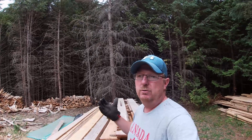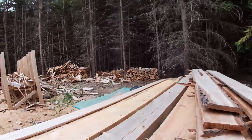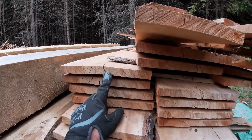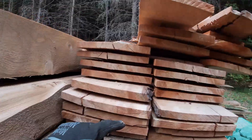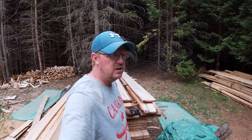I've played around cutting a few different types of wood, but nothing in too large of quantities besides the cedar. The next biggest amount I've cut has been this cherry. As you can see, what I'm running into is what they call checking or splitting on the ends. It's really bad on some of these, and that's one of the areas I still have a lot to learn about.